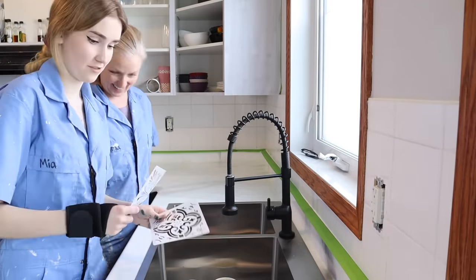It's chosen. I'm going to tape this up with Frog Tape. Now they're a little small. If I was getting these for this size of tile, I probably would have gone a little bit bigger with the stencil, but we'll see how it goes. So I'm just gonna lightly tape it. And this is another thing, I've never stenciled before. I've never done this before, okay? Basically I'm gonna dip in the paint and then on a plate tap off almost all of the paint. This is what I've seen from stenciling backsplashes in videos. You have to get almost all the paint off and then you lightly stamp.